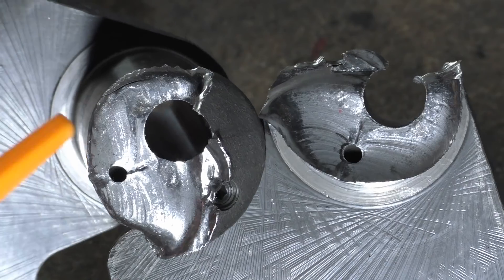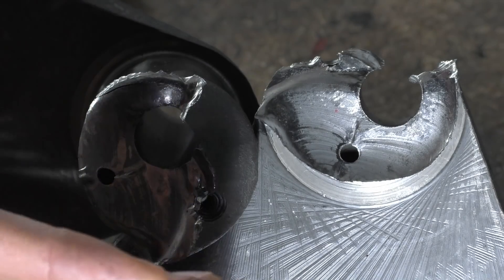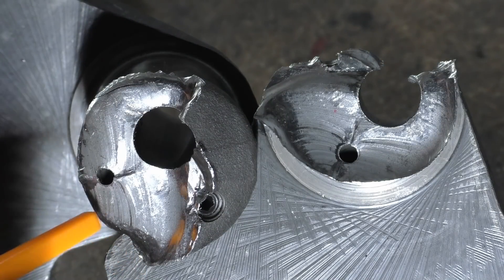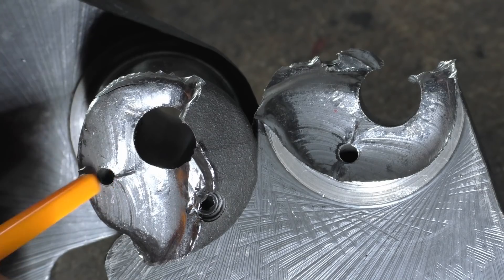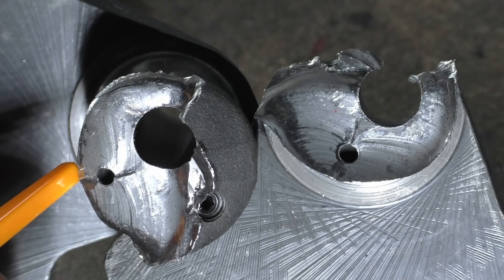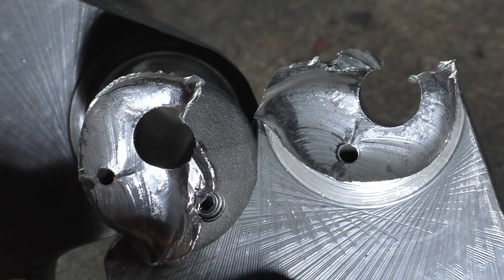You put radii on the inside as a stress reliever, and I'm going to show you how much of a difference that makes in an experiment we're going to do soon — whether you have a 90-degree corner or a soft radius and what percentage difference that makes. Basically it's split outwards going both ways. This one is the shorter distance so it's going to make it there quicker. Not only that, but when you put a torsional load on this there isn't that much torsional load on the actual pin itself — this is the interface between a lighter mass and a heavier mass.